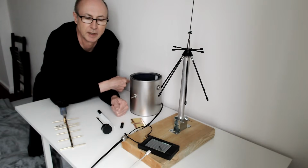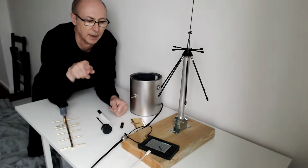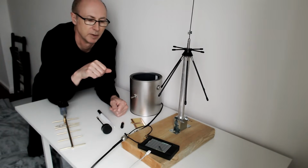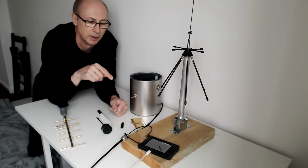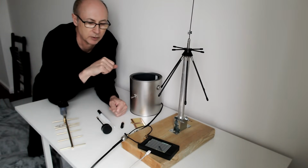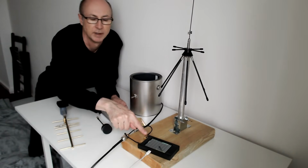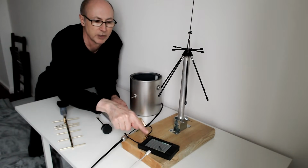And I'll calibrate it quickly. I'm only really interested in the path loss on the coax being calibrated out. I'm not going to make VSWR measurements. So I'm just going to calibrate the S21, which is the forward transmission. Where's the transmit port? This is going to be the transmit port, which is normally the test port for S11.